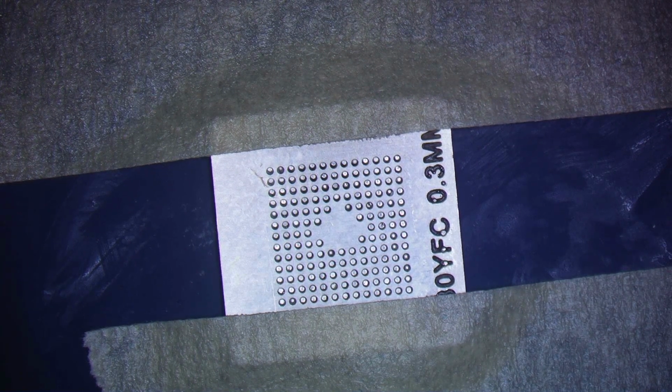I'm going to get a glove though, because I'm going to be working with that 183 leaded solder paste. So that's not good for me. I'm going to protect myself. Put the right tip on my heat gun. There we go. And again, I'm using 183 solder paste, so on my heat gun, I'm going to use what I know will melt 183 and just above it, and a low airflow. That way, not to bend my stencil.